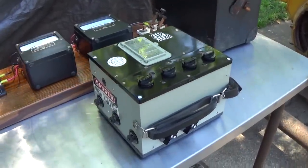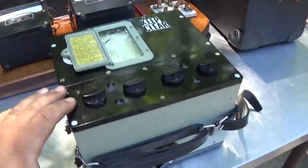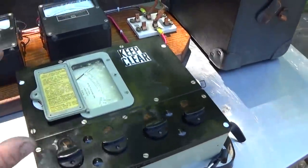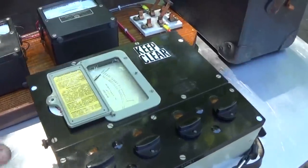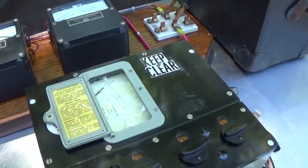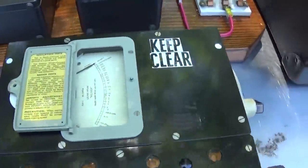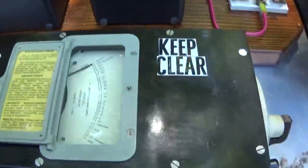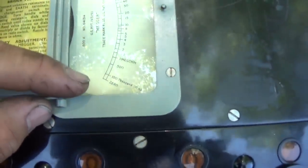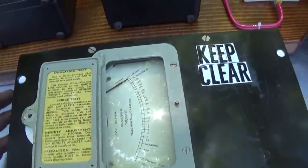Okay, for the insulation test, we're going to use this 500-volt bridge megger. This is a combination mega-ohm meter and Wheatstone bridge resistance meter. We're not going to worry about the Wheatstone bridge part of it right now, but we're going to use this device to determine if there's any leakage, or the amount of leakage, in the stator and rotor windings in the actual generator itself. What this comprises is a 500 volt DC generator, it's hand crank, and then a couple output terminals and a scale that reads in mega ohms, from 100,000 ohms right up to 1,000 mega ohms at infinity, so a complete open circuit.